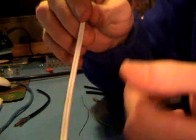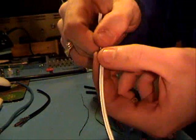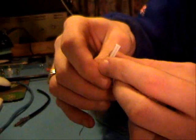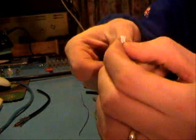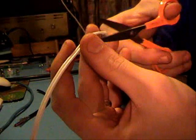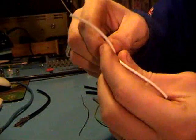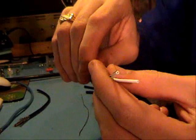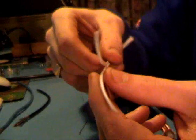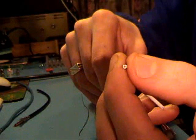Then we've got bell wire. It's actually two wires bonded together in the middle — that one's just pure white, and that one's got a tracer, so you can tell what wire is what without having to run your finger down it. Very easy to pull apart — just a pair of scissors, make a tiny little cut and then you should be able to just pull it apart. Not designed for high voltages — possibly maybe 30 volts maximum safely. And not very good at current rating either — it's a very small cable.